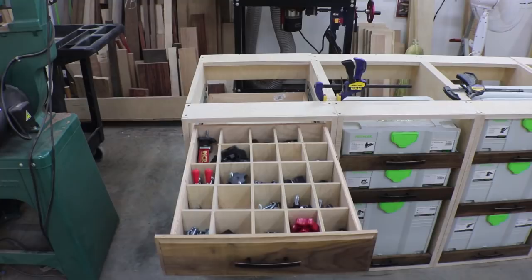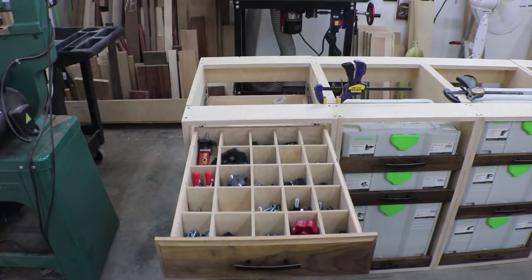Okay, so this top drawer in the end of the cabinet is all the parts and bits and pieces that I have for making jigs and toilet bolts for T-track, etc. So I just cut some of the leftover 1/4-inch material and half-lapped them so I could create the grid. Popped them in the drawer and started filling it up. It's quick and simple organization to go that way.